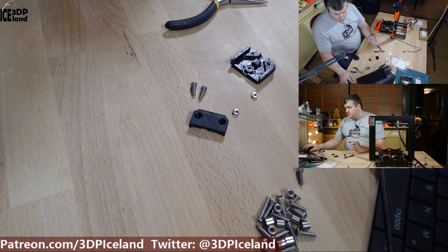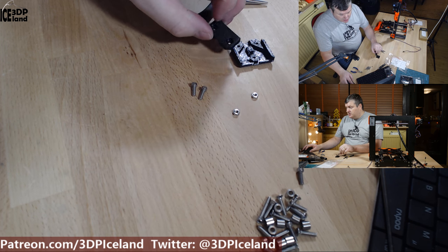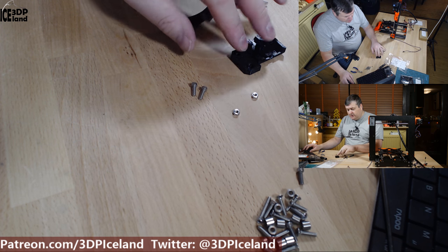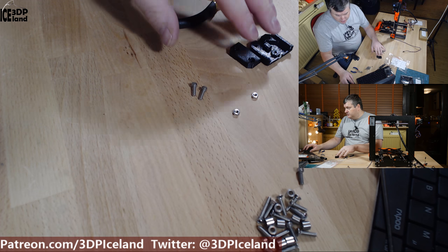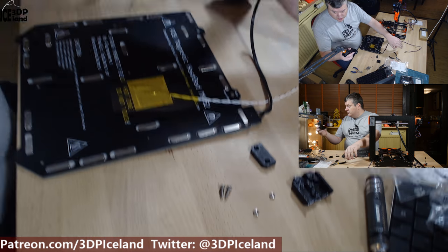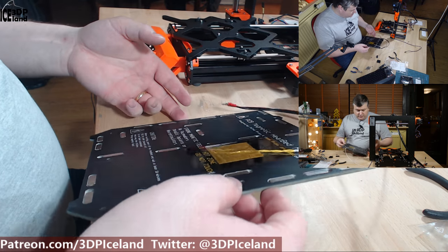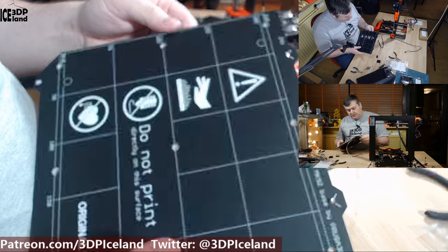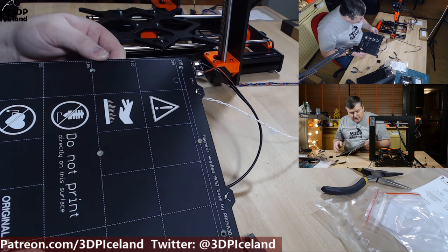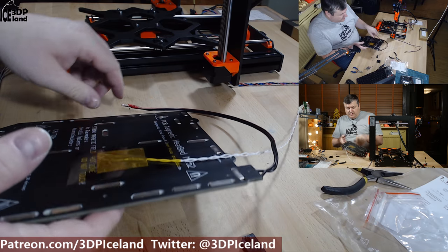In step 7 we're going to start with the heated bed. They note there's a new design on the heat bed cable covers — from January 2018 they shipped the redesigned cover, and I got that, so that's good. The heated bed is now 24 volt with just two wires to the heated bed and LED, as before.